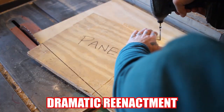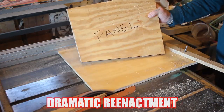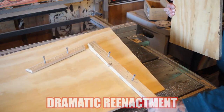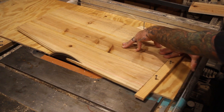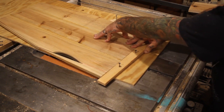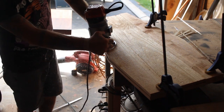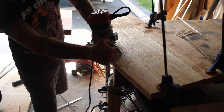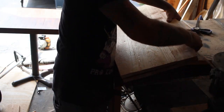I screwed a board to the back of the sheet of plywood behind my glued-up panel — this will secure your panel as you run it through the table saw. After that I traced the back side of the coffin onto the front side and brought that over to my table saw and cut that out. To make sure they met up perfectly I used a flush trim router bit and ran it along all the edges of my coffin slash bat house.